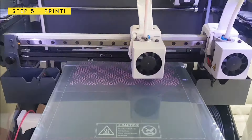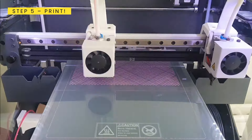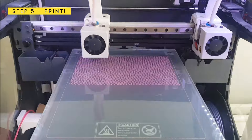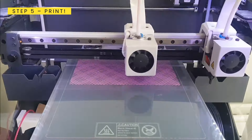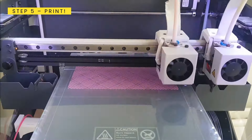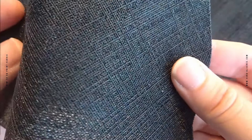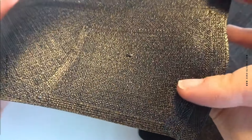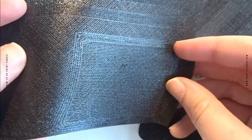Printing with flexible materials can be especially challenging depending on the printer. In general, printers with a feeder close to the nozzle, like direct drive, work best with flexible filament. However, it doesn't mean that you can't print 3D printed fabrics with Bowden-style printers — I do it, for example. It will just require slower print speeds and more fiddling with the settings until you find what works for your printer. But it's all worth it, because being able to 3D print fabric gives you a lot of options to be creative around fashion, since you can be in full control of the shape and properties of your fabrics and create exactly the amount you need, so there's very little waste compared to traditional fabrics.